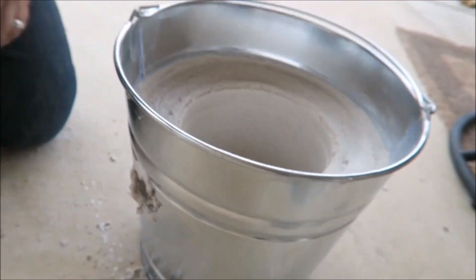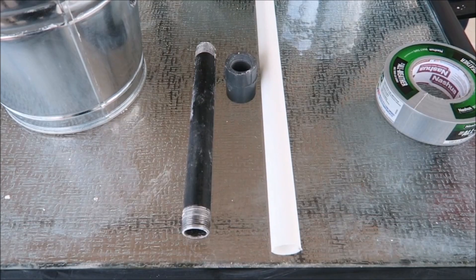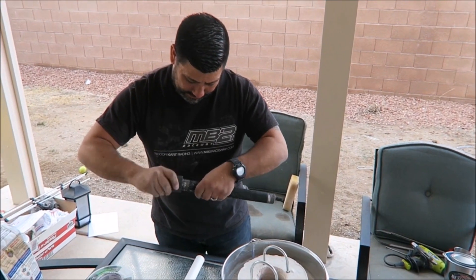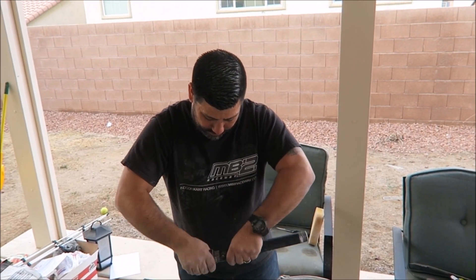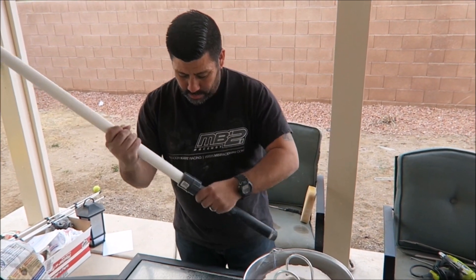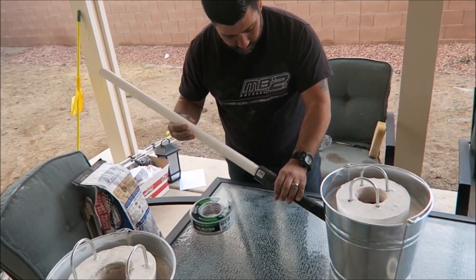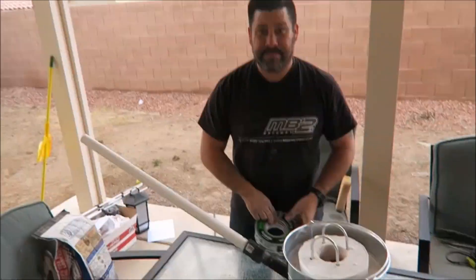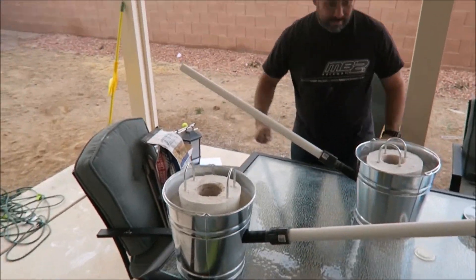For the blower tube, we're going to use a one-inch, 12-inch-long black gas pipe, a two-foot one-inch PVC pipe with a threaded coupling and a slip coupling, attached together like this. It's pretty easy — no glue, pipe compound, or anything of that sort. Everything fits nice and snug. Then you sit it in at an angle just like this and get ready to light the foundry.